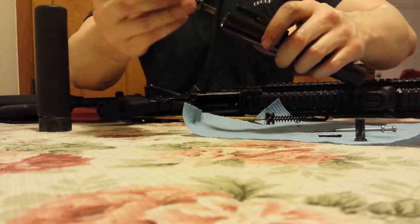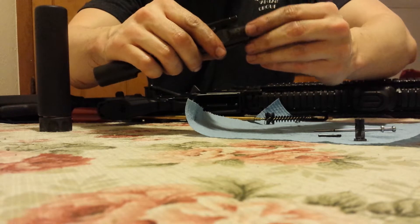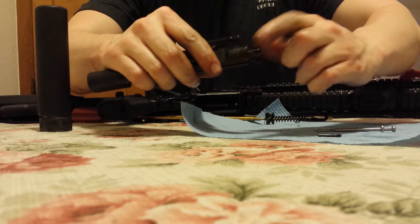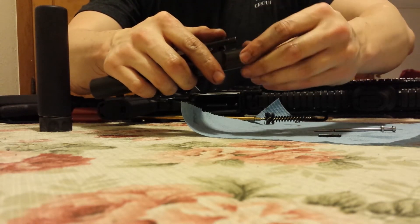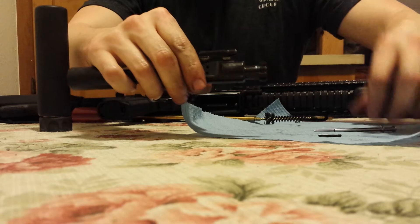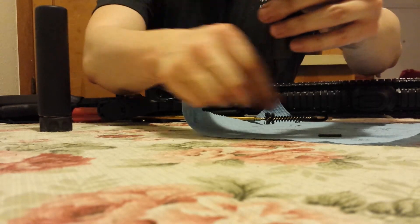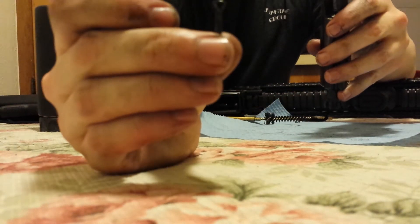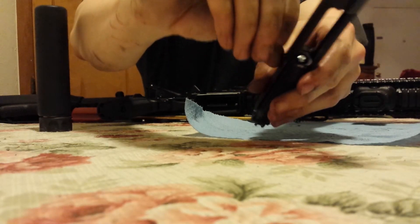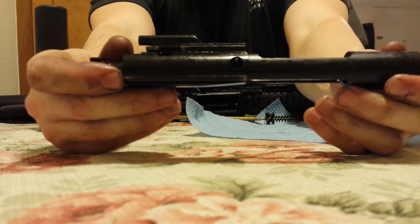You put her together the same way you took her apart, same order. Bolt goes in collapsed — turn that extractor far to the right for the right-hand carrier. You'll see a hole in the bolt — drop in the cam pin, pull the bolt forward, and spin the cam pin so it sits like a T. Drop the firing pin in, make sure it's all the way forward. Insert the cotter pin up and down — that just keeps it from getting bent. I've found that putting them in this way prevents that.